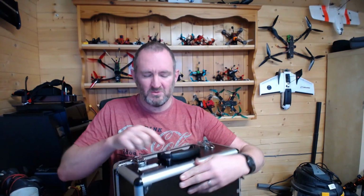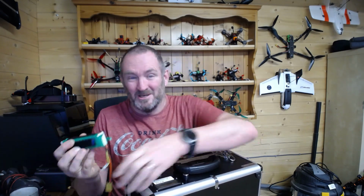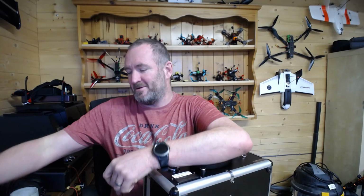And what that's doing is it gives you a complete interface on which you can set the temperature you would like. You can configure the type of battery with a low voltage alarm. You can do all sorts of stuff. And the end result is the inside of this box gets up to a lovely temperature and stays there. So using effectively one of these with a car charger adapter on it, which is also available from Hadi-RC, I can get my lipos all up to sort of 30 odd degrees on the way to the field, and then just off one of these batteries keep them at 30 degrees, which the end result means there we go, I end up with a super warm ready to run battery at the point in time that I need it.